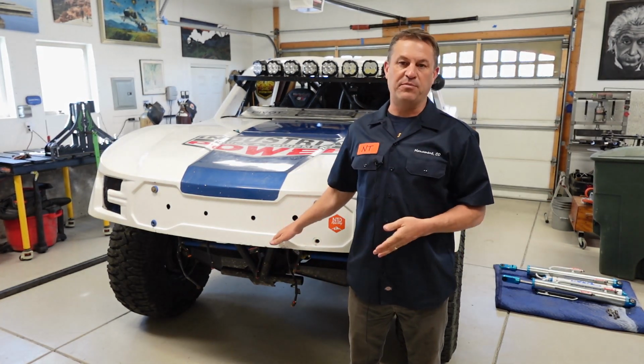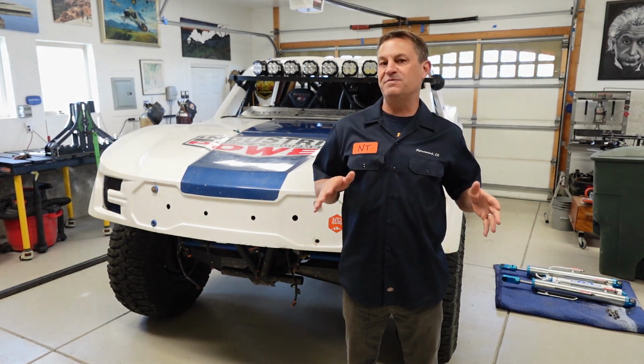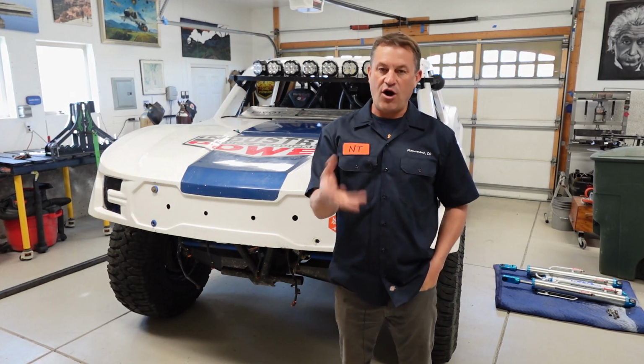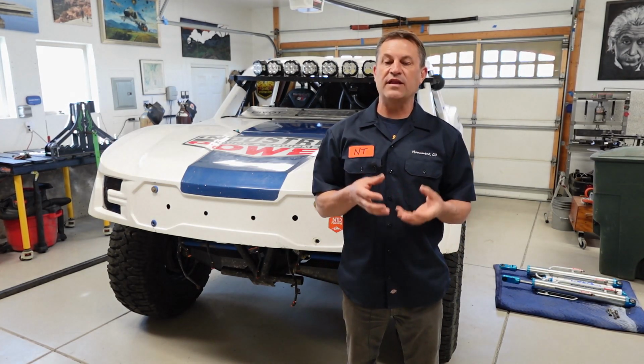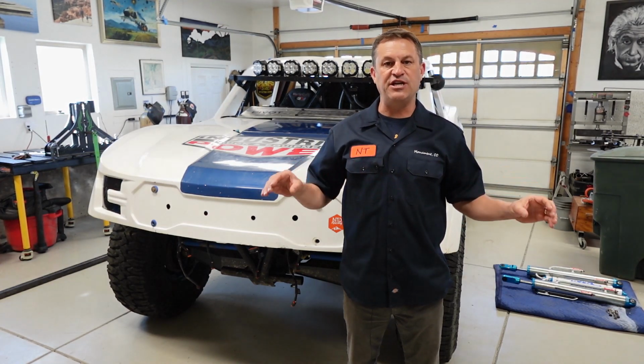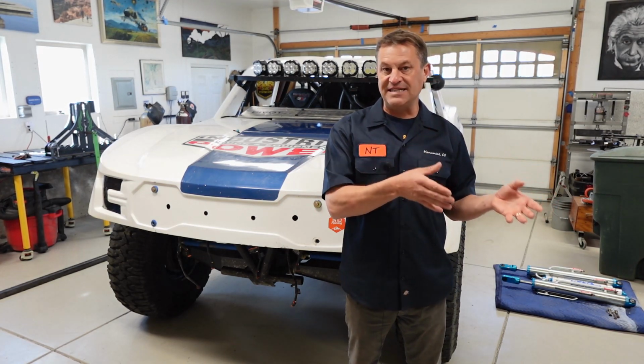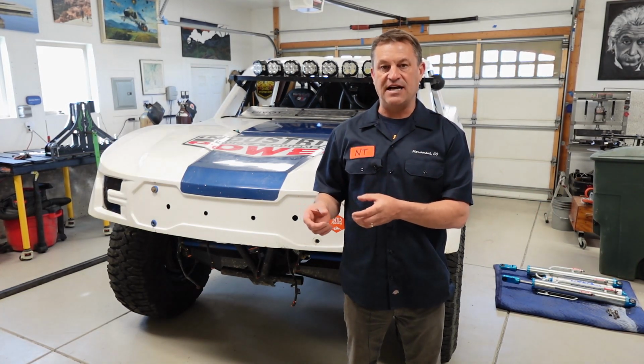We're gonna build a bumper today, which is gonna require us to use just about all of the tools in the shop. Now, one of the neat ones we're gonna be using is that Swag Off-Road Hulk. And that is a tube roller. And one of the things that we're really trying to flesh out today is how do you roll a tube which generates a large radius tube and then translate that into something that you can use in Bend-Tech software and then generate tubes with computer aided design that we can cut on the Dragon A250.